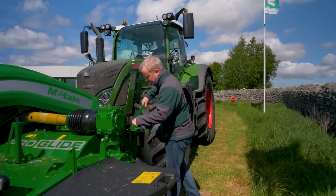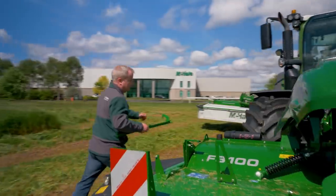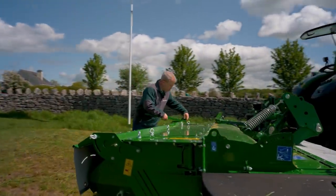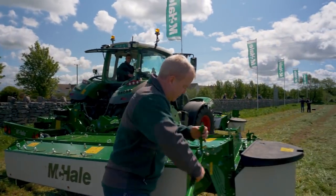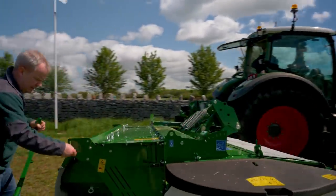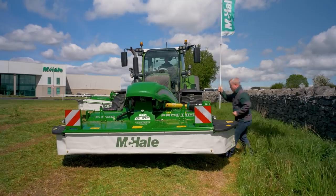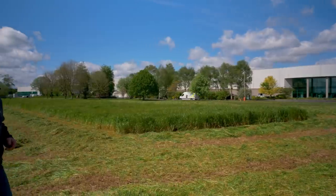We have the blade changer here with a little curve on the end. We open the eyebolts and bring the swath boards out to full width on both sides of the front mower — quite a simple adjustment. Moving back to the rear mower, we open the outside board out to full width and turn down the rear spreading vanes. We fold up the rear curtain at the back, then pop the handle back into the front mower. Now still running at 1,000 RPM on both gearboxes, we've adjusted both front and rear mowers to give full width spread on the grass.